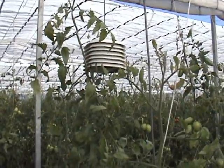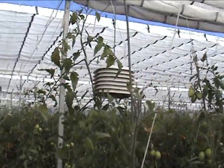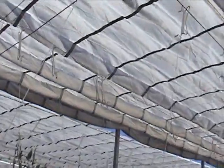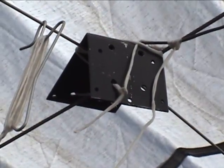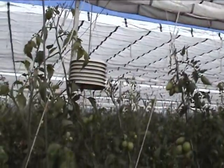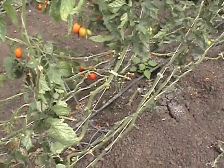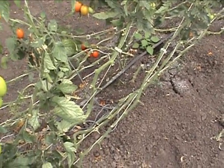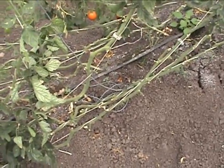To monitor indoor conditions, there is an air temperature sensor and a relative humidity sensor that will monitor the inside environment. In addition, there is a black surface temperature sensor, which is going to measure the temperature that the plants would be exposed to should the roof be retracted and the plants be in full sun. This will help regulate the indoor temperature and can be used for an alarm setting to trigger automatic alarms in the event that the inside temperature is excessive for a longer period of time.